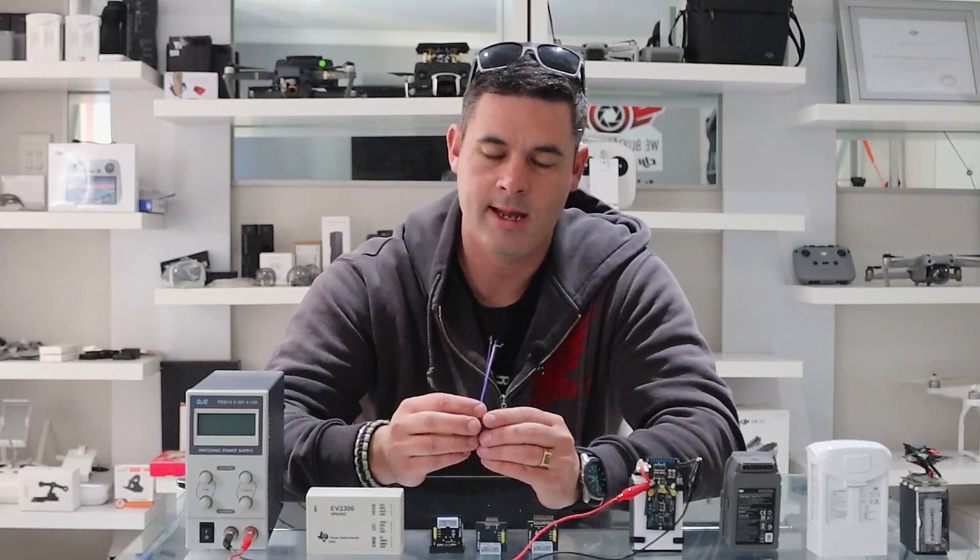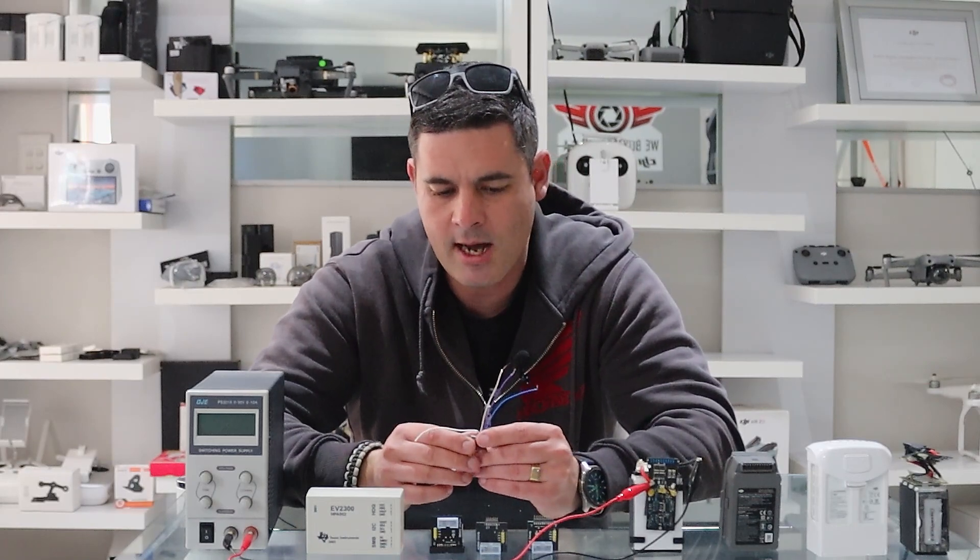All you're going to do is follow that diagram — pin your ground into ground, your clock into clock, your data into data. That's it. Three loose open-end wires, plug into your battery, plug the board into your laptop, then open up the firmware and click connect.